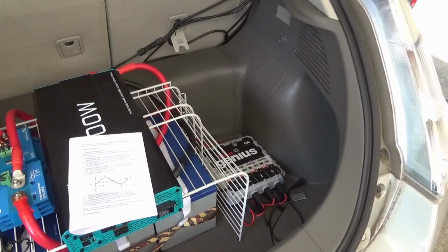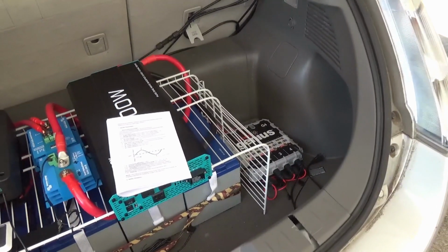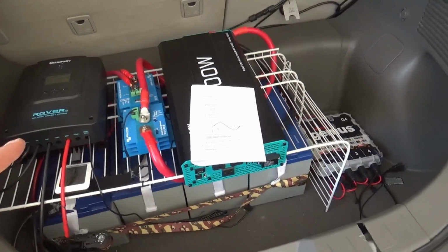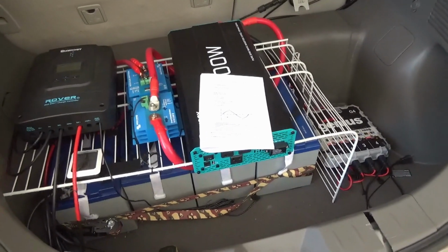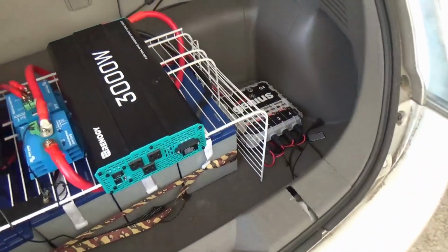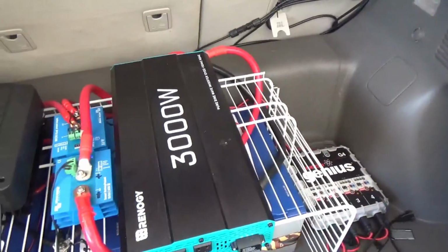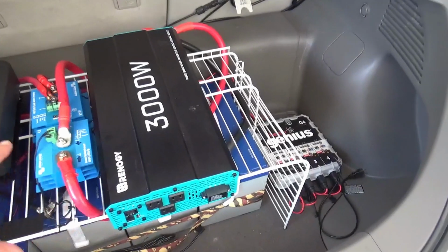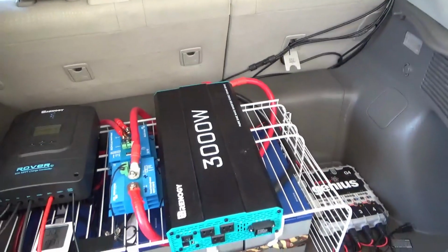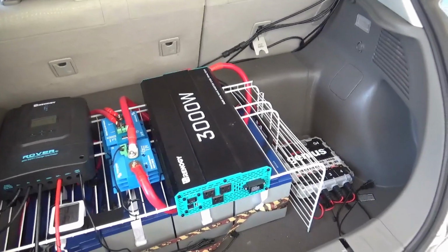The pros of applying a climate control to a system like this are that it's going to make life on all your electronic components a lot easier. It's going to make them last a lot longer. Electronics like to operate at about the same temperature we do, which is around 75 degrees. That's when everything lasts the longest. Additionally, while you're going to have this top cover on here, so the unit's only going to be effectively cooling the maybe 5 or 6 cubic feet of space that we have back here, a lot of that cold air is going to leak out into the cab. So when we get into our vehicle, it should keep the entire interior of the vehicle a little cooler, which is an awesome side effect.